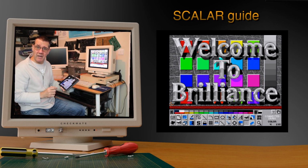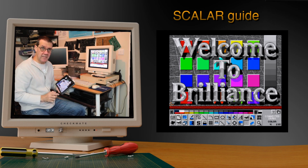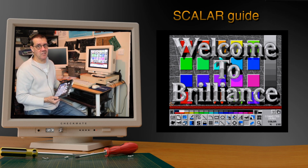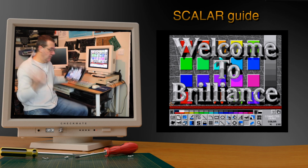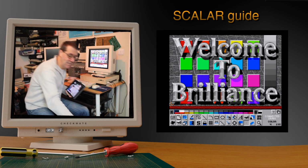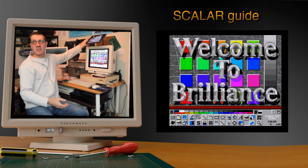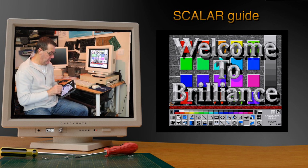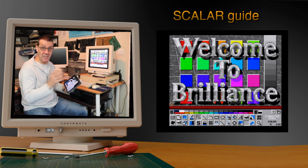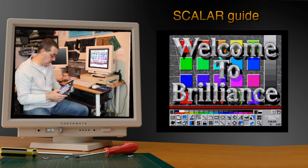Now, some people are having issues with connecting to it. That's going to be a local issue. It's not going to be the GBS control. Usually, if you move it somewhere else where it's less noisy, if you've got lots of stuff competing, it's not the most powerful. It's a tiny little board. Okay, give it a chance. If you put it up over here, next to the monitor, it's probably better. But some people are having the odd issues with it. That would be your situation in your house. Too much noise. Move it to another room where there's less electronics.